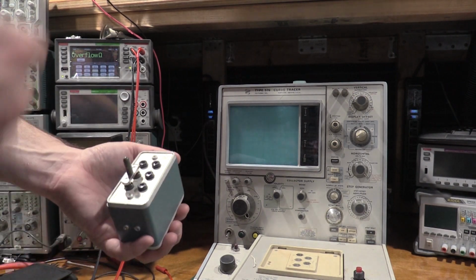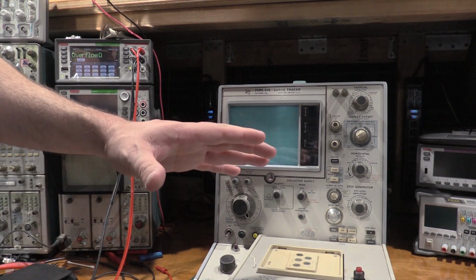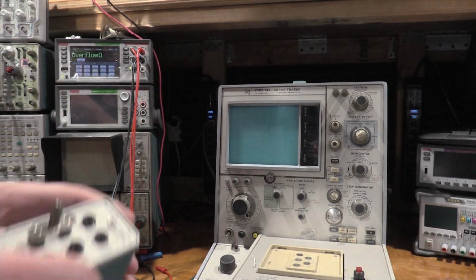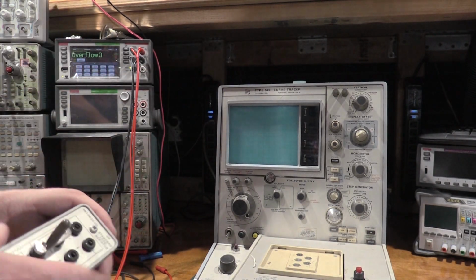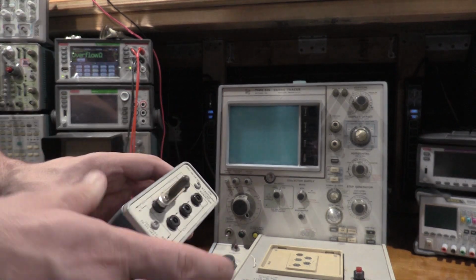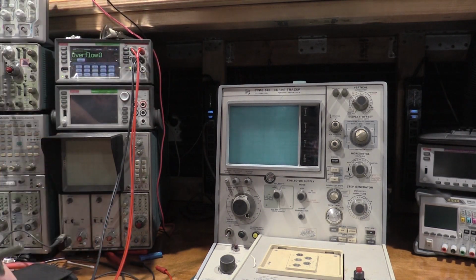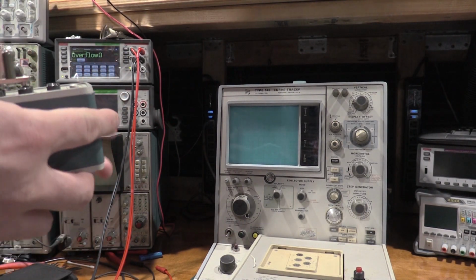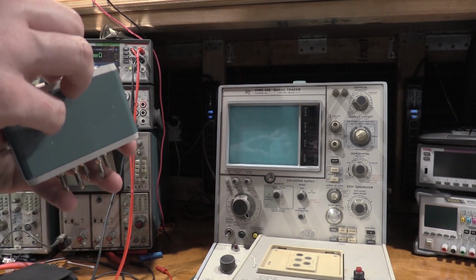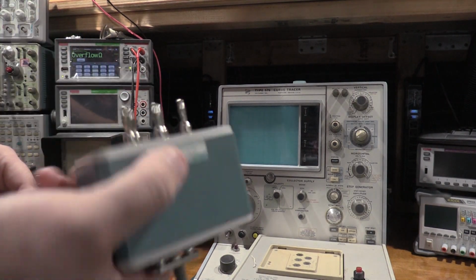What that tells me from at least the rudimentary tests that I can do is the 176 is measuring exactly as it's supposed to, because it showed me correctly what it should when I had the correct resistance, but not when I was off by a lot. At the moment, this is the best I can do in the lab. I don't have any incredibly low value, high wattage resistors. I'm going to have to order some, which I'm not looking forward to. Those are probably going to be expensive. But we'll have to rebuild this resistance box.